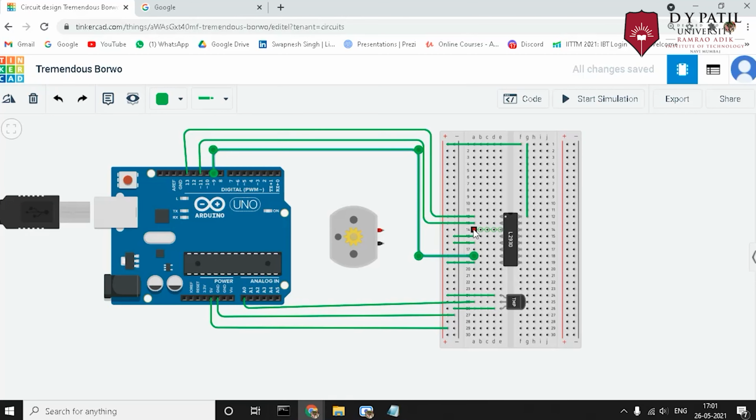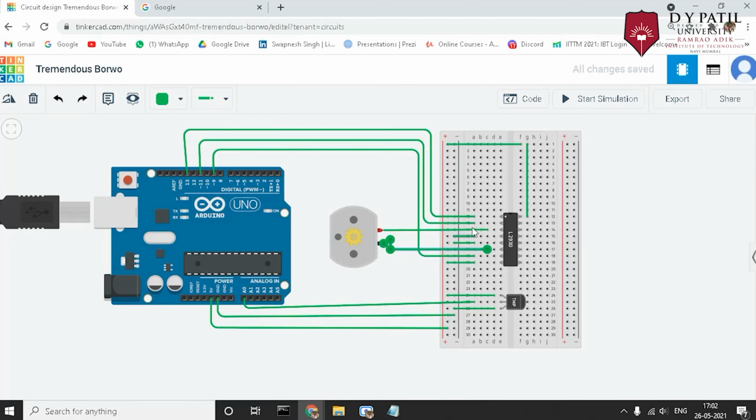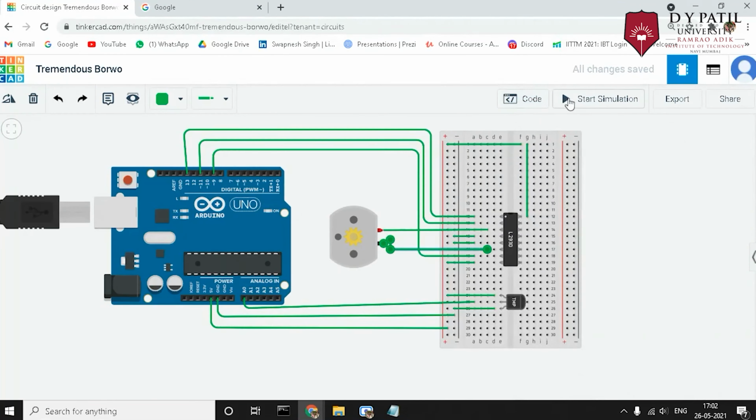And lastly, for the output part of the IC, that is the third pin and the 6th pin, we connect them to the DC motor. It usually gives the output: when the temperature is greater than 27 degrees Celsius, the DC motor is in on condition. If it is less than 27 degrees Celsius, it is in off condition. Now, we have finished with the hookup. We need code for this, which is available below in the description box.